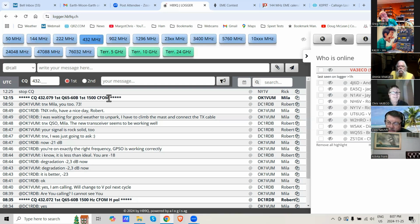So what they decided is, who should do the Doppler correction? Should it be the DX station? Should it be you? How are you going to coordinate that? And they said, well, hold it. What if you each did your share? In other words, have it so that if there was a ham guy sitting on the moon, he would be hearing both signals at exactly 432.079. So that means I have to shift mine a little bit. And depending on if the guy's over in Europe, let's say, and the moon is coming up for him, he might have to shift the other way.